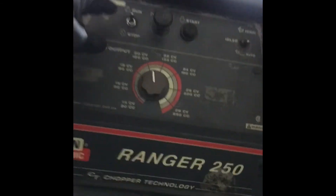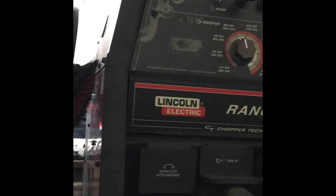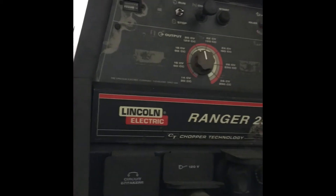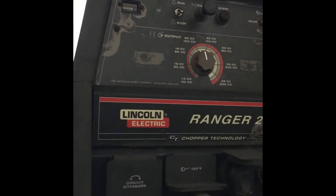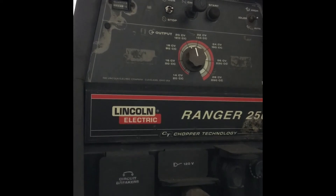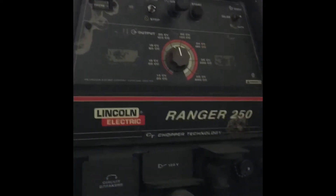What I'm thinking now is that this was a crank no-start condition, and the guy just kept cranking the thing. The starter got hot, which is why it wouldn't turn this morning when I got here. I got it to turn, obviously, but the starter's probably on its last legs now — probably melted most of the solder out of the armature. So now we move on to part two of diagnosis of this crank no-start. I'm going to check for spark first, and then check for fuel. I don't smell anything yet — it should be easy if this guy ran out of gas, but who knows.